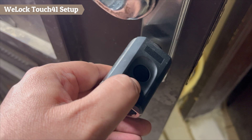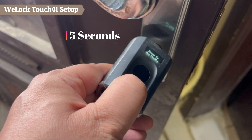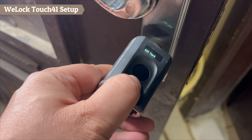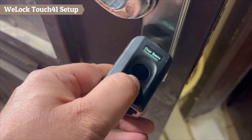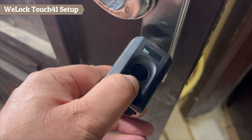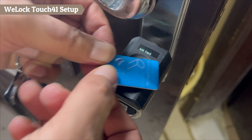To set up the door lock, you need to press the button for around eight seconds, then hold the button again for five seconds. You will then see the admin controls, where you can add fingerprints to unlock your door, delete fingerprints, clear all RFID cards, use remote control, turn off Bluetooth, and much more. Let me add the RFID card to the smart door lock and follow the steps to configure it — and boom, it's done.